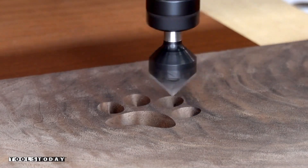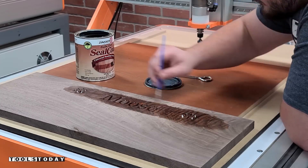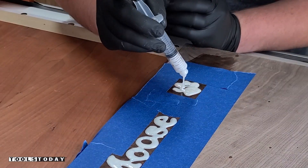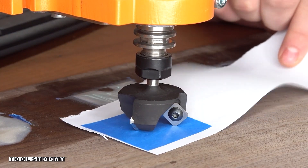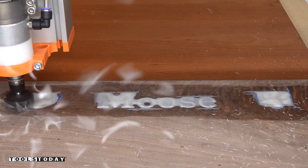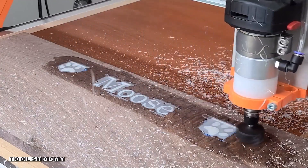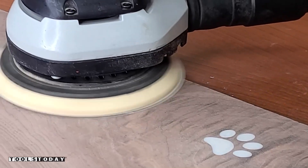After that's all done, we're going to use some sanding sealer to seal up the grain so that when we put the epoxy in there, it's not going to bleed into the grain of the walnut. I use some painters tape just to prevent the epoxy from getting where I don't want it. We got all of that inlaid into the carved out areas. I let that dry overnight, and then it's time to flatten it all off using the RC-2265 three-wing insert carbide flattening bit. I used a piece of blue tape to set my Z zero position just above the surface of the material — this will allow just a little bit of material left to be sanded down so we don't carve into the actual wood. Get that vacuumed off and then we can begin the sanding process with some 220 grit sandpaper.